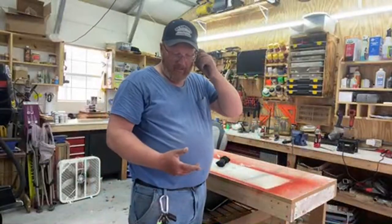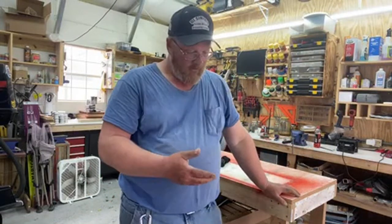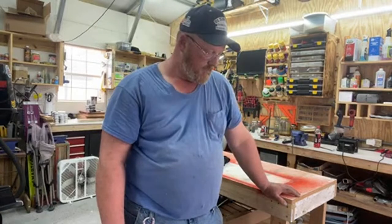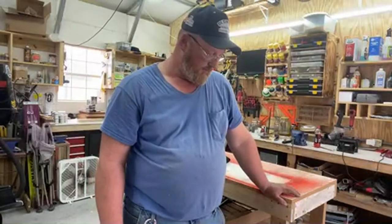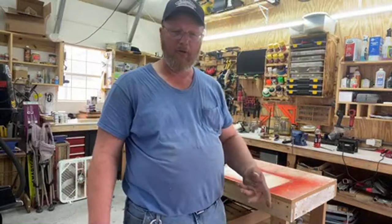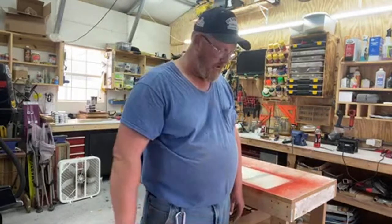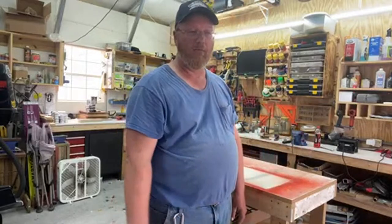But if you don't want the handles on them, you can still concrete them up, look over the holes and everything, and after the concrete sets, you can get rid of the rest of the bucket. If you don't have a bucket, put it on hard ground or something. If you're going where it's mud, small gravel, and a little bit uneven, that's why I like a bucket. It just holds everything together. It's easier to put some stuff in the bottom of the bucket.